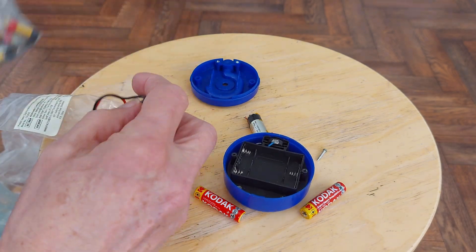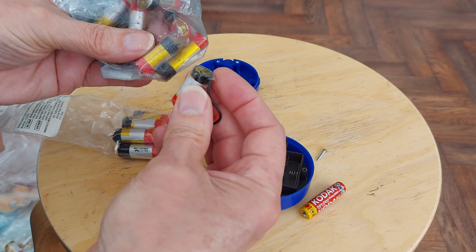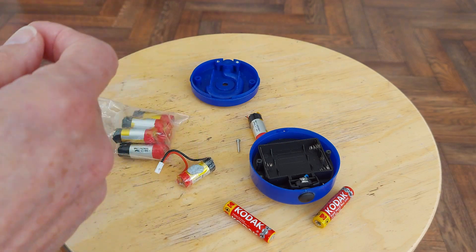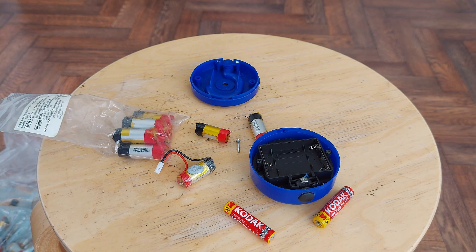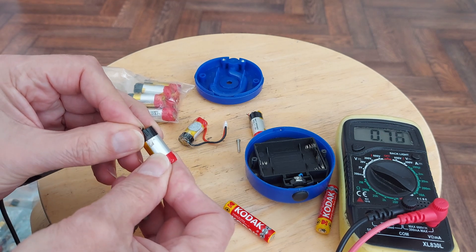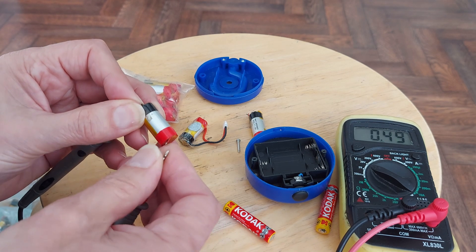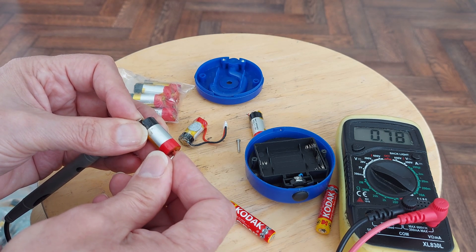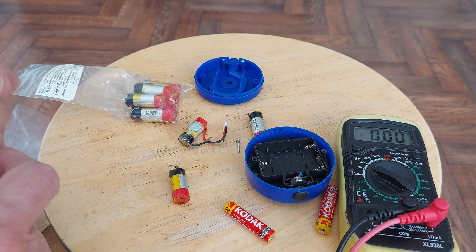All right, a bit bigger. There's one — yeah, it looks the same size. I'll just put a meter on it and see what sort of power we've got in there at the moment. That's a bit low. When they're that low, there's a good chance they won't actually charge up properly. They really don't want to be much below three volts, so that might not be a good one.